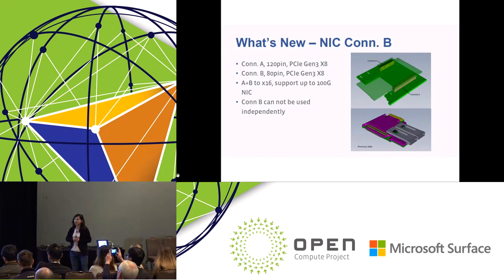Okay, so this is NIC connector B. We already have NIC connector A. NIC connector B is another x8 PCIe Gen 3 added for the NIC card. So A plus B, we can make PCIe x16 to support up to a 100 gig NIC. One thing I want to highlight is that connector B is not able to be used independently. So you will have different options. Based on your use case, you can choose either to use connector A only, to have up to x8 PCIe, or use A plus B